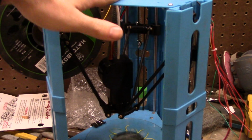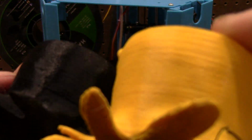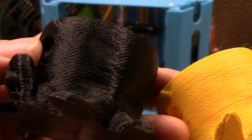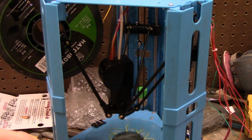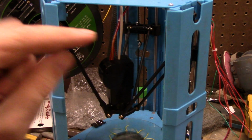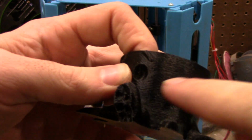It'll go on my printer shelf, get used for small parts that I don't care about precision, because as you might be able to see, it's more visible on the black to my eye. Camera, yeah, see that striping? That is because it is 32 steps per rotation max on these little steppers that are used in this. These are geared steppers, 5-pin geared steppers. What that means is the resolution isn't there. You get these marks just because it's only got 32 places it can set.